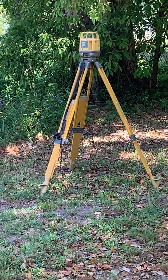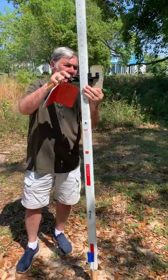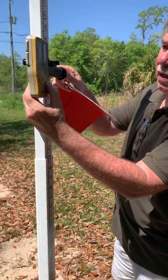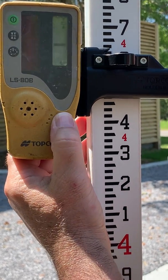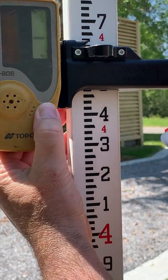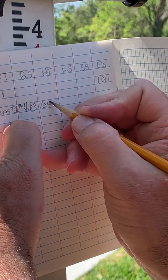The control position is at the rod. We're going to put the rod on top of the stake, and as we move the sensor down, we've eliminated the beeping. I'm watching the video on the screen of the sensor to determine when we've hit the spot. As we come down into this, we're finding that we're hitting the spot at 462, and as we're locking off on that position, we're at about 463. So we're going to mark down 463 as the back sight. Adding that to the beginning elevation of 100, it comes up to a height of instrument of 104.63.